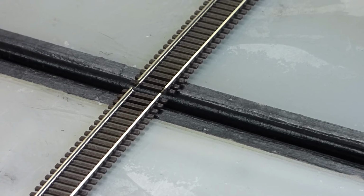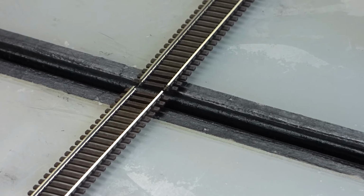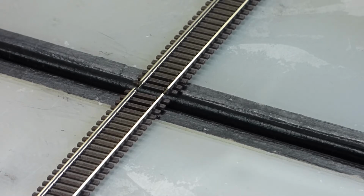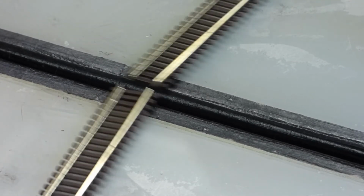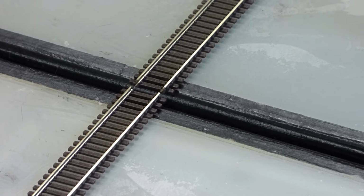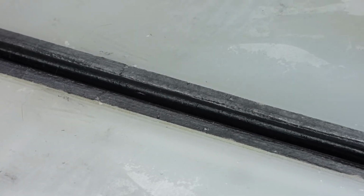Now you can get thinner mirror, that'll cut that back some, but you can't just run down to your local home store and buy that. Running it this way, things by it or whatever, it's all good. But anything up against it, you end up with a gap. It's not a fully connected thing. Now, what I'm going to use in that situation is called first surface mirror.